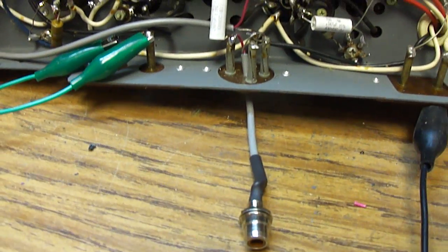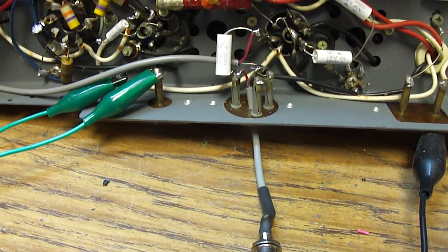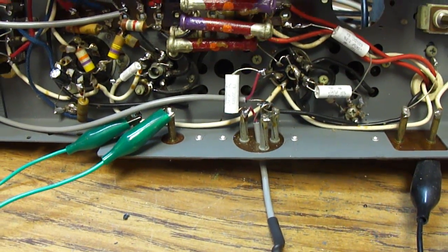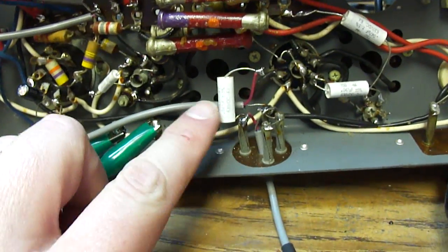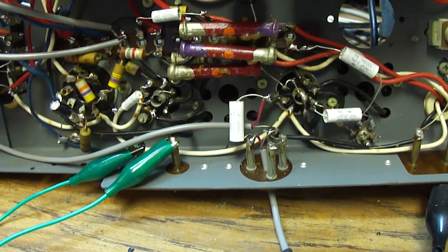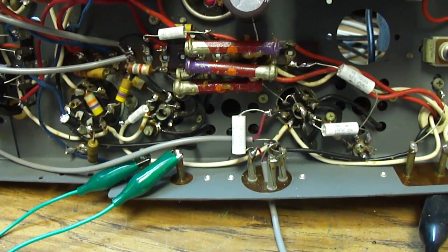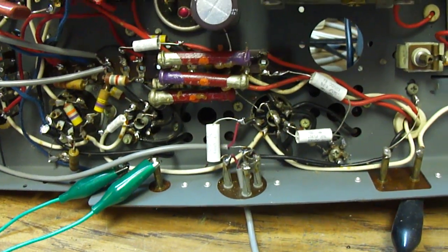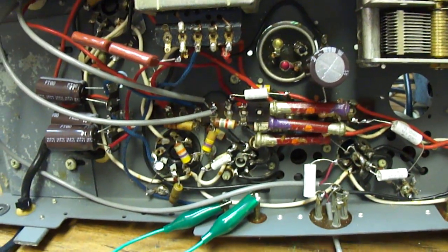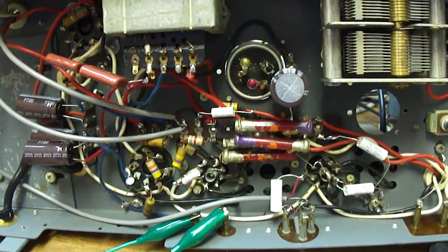Here's the modification I did to the gramophone input. Being British, it calls this the gramophone input rather than phonograph. I put an American-type phono jack on here and a capacitor to prevent high voltage from coming back into the device if there were a short in a tube, or to prevent DC from an external device from upsetting the bias on the audio preamplifier tube.